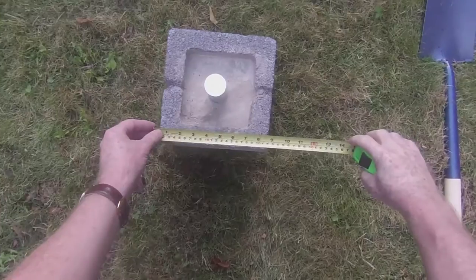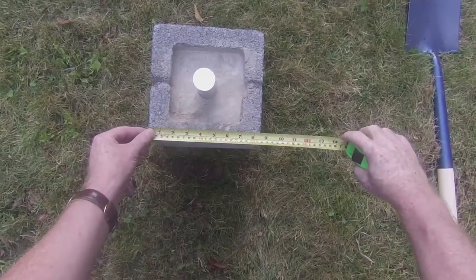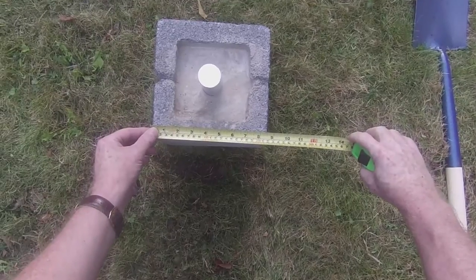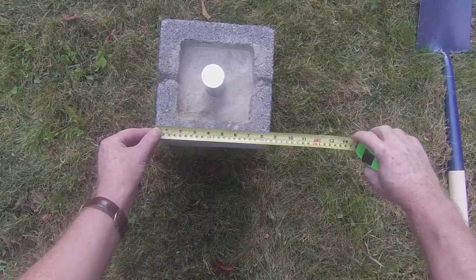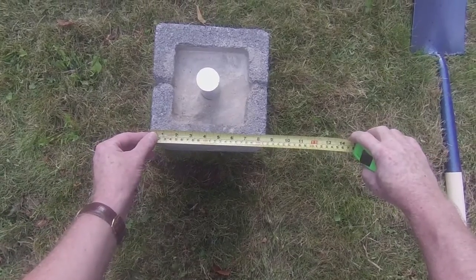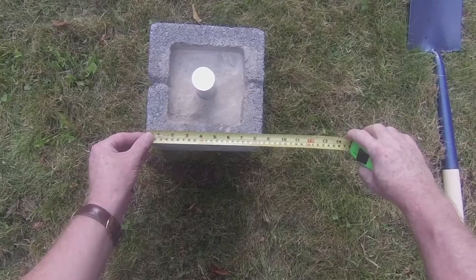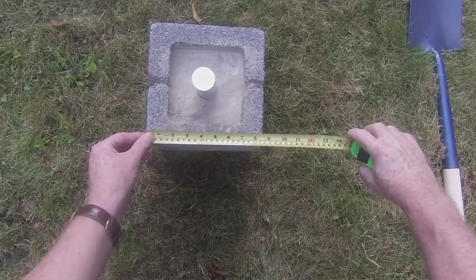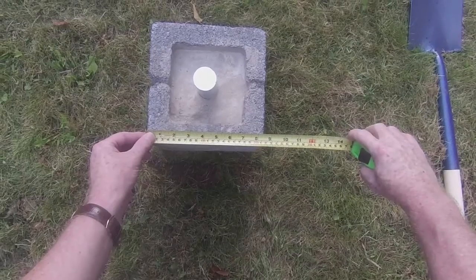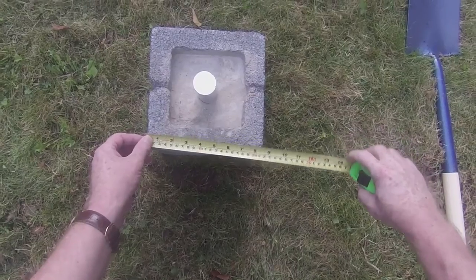We've just put this video together to show our customers the easiest way to install one of our rotary clotheslines. We'll be installing a TS4140 here, and as you can see, we've started with a precast concrete block. We've put this together a couple of days before the job and let it set so that it becomes nice and solid. And this will make it a lot easier to get the dryer straight and level, and definitely make the install easier to do.